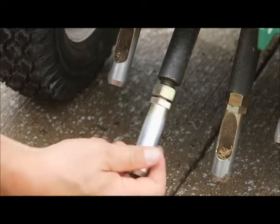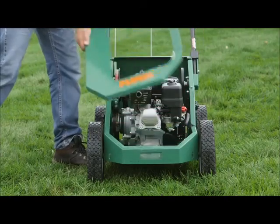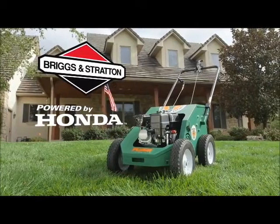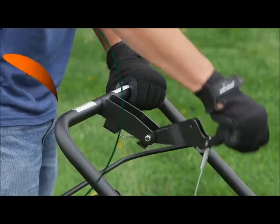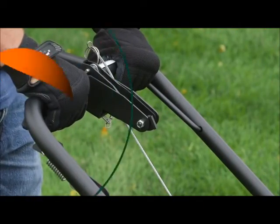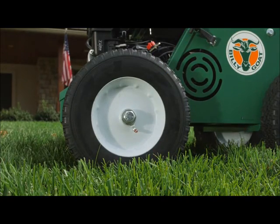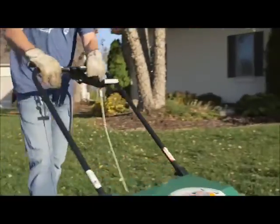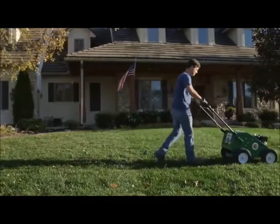With only four screw-in tines, multiple tine options, no chains and a no-tool removable cover, maintenance and tine changes are simple. The 18-inch unit is available in your choice of either a rugged Briggs or Honda engine. The unit is actuated by lowering the tine lever from the center of the operating station, then engaging the operator-friendly tine bail at the handle. Four 12-inch semi-pneumatic tires make for smooth turf rotation and add to machine stability. When approaching obstacles like sprinkler heads or clean-outs, simply let go of the tine engagement lever to avoid damage and re-engage after the obstacle has passed.